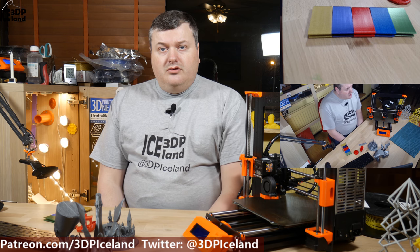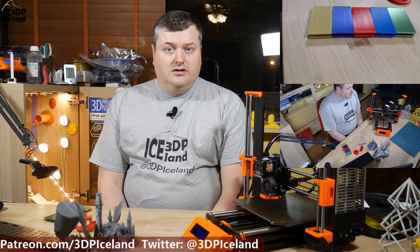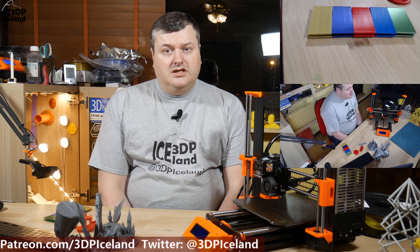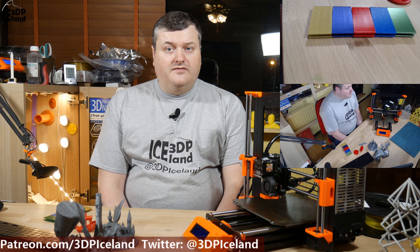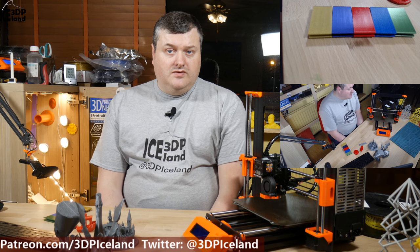I had one problem initially with this printer when I started, and that was in regard to Octoprint. There were some layer skipping issues and faulty prints happening. It came down to a firmware change Prusa did, and now with the release of the latest firmware, those issues were fixed, and that's basically the only issue I had with this printer.